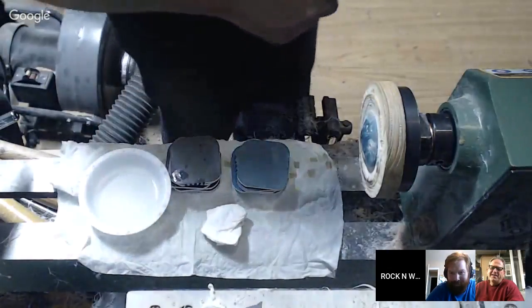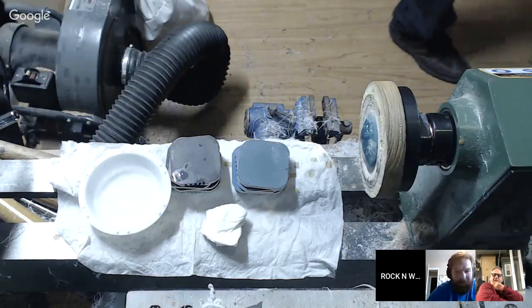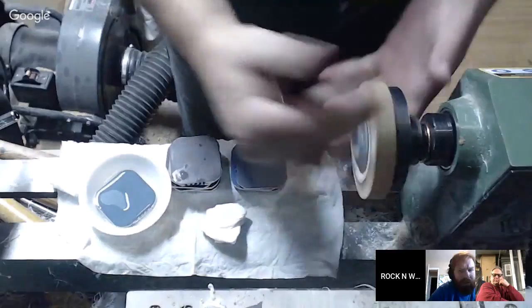Well, and why is that? Because you can turn bowls out beyond the bed of the lathe and whatnot, or why? I can turn slightly bigger bowls, but it's got a bigger range capability of RPM. So the Harbor Freight one, you can go about 600 or 700 to somewhere around 3,000. The Rikon, you can go all the way down to somewhere between 220 and 250, and I can crank the RPMs on the Rikon up to about 3,400 or 3,500. And then the head and tail stock is way more accurate as well. And it's a lot quieter. So it's a nice lathe.